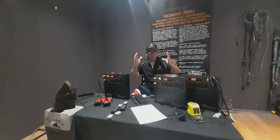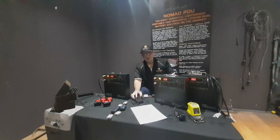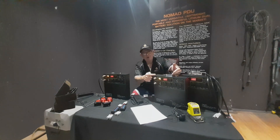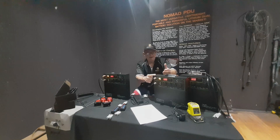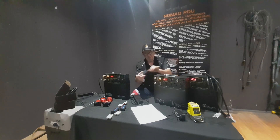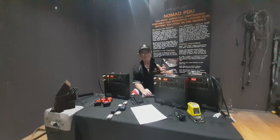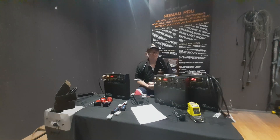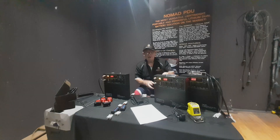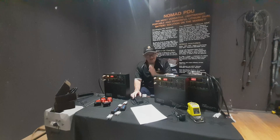So there are some basic reasons the analyzer is such a good tool to have — you can look at what the issue is with the whole setup. Is it the charger? Use the analyzer to test it. Is the charger showing red, and when it goes green what is the voltage showing on the Nomad? If it's saying 12.1 or 11.8 and charging has stopped, it's the charger. If the analyzer at the output shows a different voltage from the screen — out by 0.45 or a couple of points — it's just the voltage screen that needs replacing. The actual battery and BMS are fine; it's just a dumb screen with an issue. That's basically AC/DC charging covered.